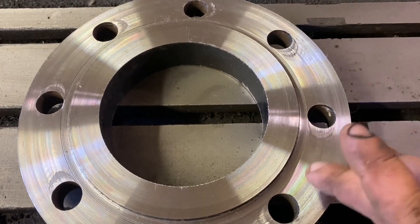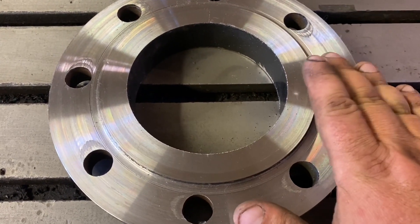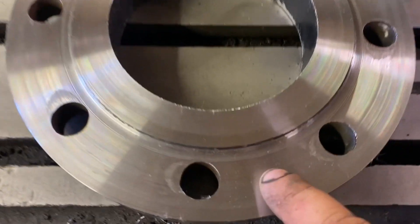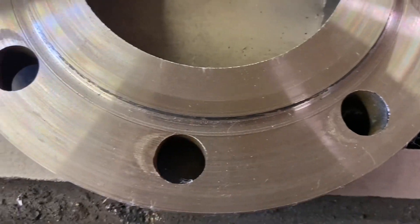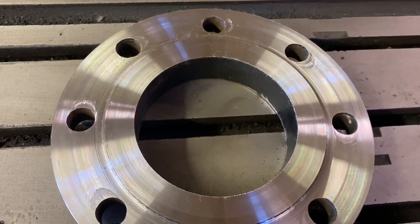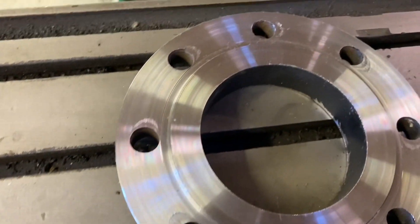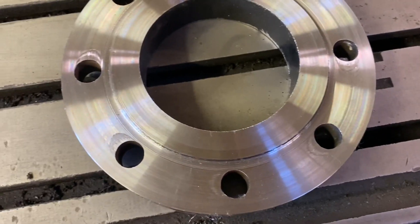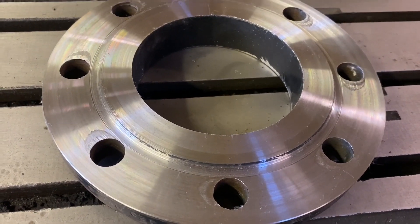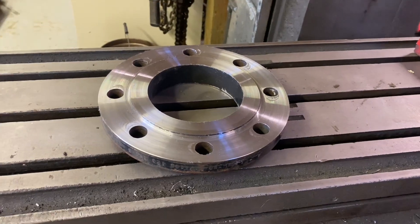That finish is just perfect. It's hot — I can't touch it — it's a thou and a half over, but by the time it cools it'll be perfectly good. I did skim this off to make it parallel and all that. That cutter — that fuzz is just from a rag — just smooth, there's not a ripple in there. The cutter held out through that interrupted cut, so very cool. I'll get the information on that cutter. So yeah, pumped those out for the farmer — less than an hour for both of them. He'll be very happy and this will accomplish what he wants to do. This is Adam from Small Town Machine Shop — please comment, like, subscribe, and thanks for watching.